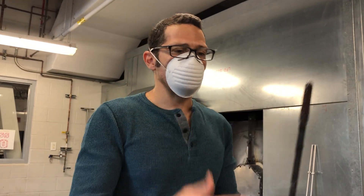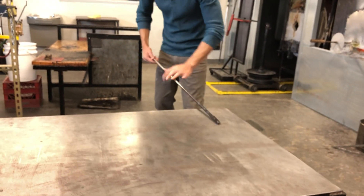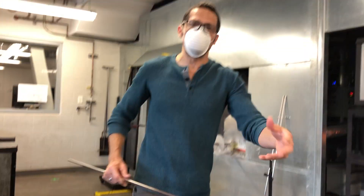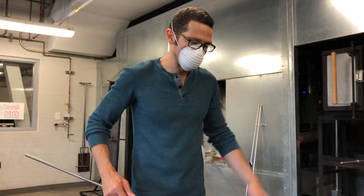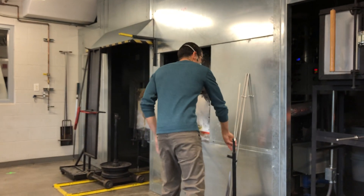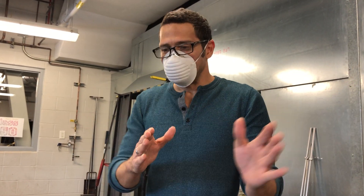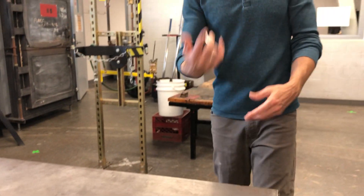This comes from the punty being too hot, blindly pushing forward. Most people do that — they're way back and they think they made a good punty, then they go and stick it. When they go to break it off, it falls off the punty and it falls off the blowpipe and dies. So those are three common mistakes — typical things people do: marvering at an angle, pushing forward and pulling back, and not holding it up.